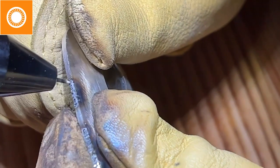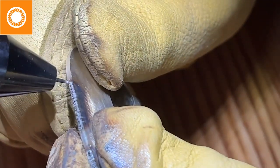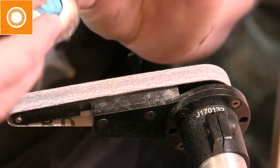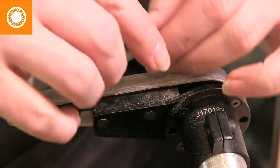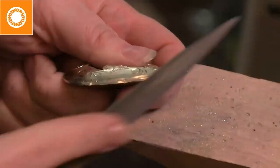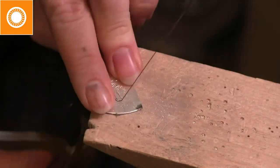I can even set this at a little bit lower setting, but I believe I left this on 40. It still gives me a nice deep weld, but notice my surface isn't as bad this time — last time I had a lot of deeper areas. I clean it back up and everything looks nice as far as my seam goes. I spend the time finishing up that seam, making sure everything is solid. Now I'm knocking off that upper and lower surface — I decided to use a file rather than the belt sander here for a little bit more control.